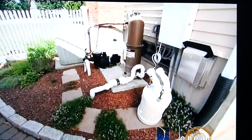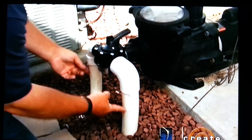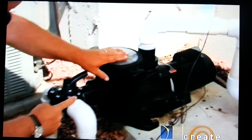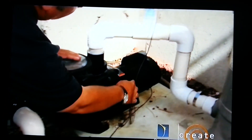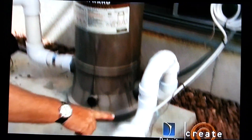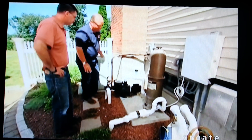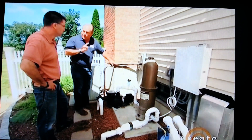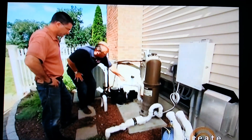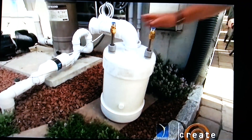Let me show you how this system works. Here is your pool filter system — it's a pretty standard package. You've got two lines that come from the skimmers at the pool, and they come together to go through a leaf strainer to catch any leaves. There's a pump that pushes water through the strainer and through this cartridge-style filter, and it returns back to the pool. At the same time, you've got the refrigerant lines for your air conditioner carrying hot refrigerant. There's a pretty ingenious invention — a heat exchanger made exactly for this reason.